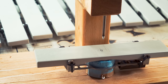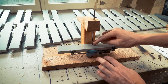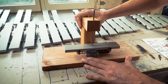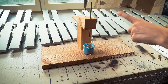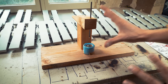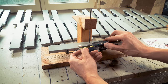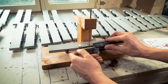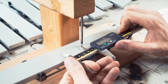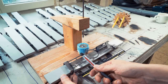These want to be hit to the left, so I'm going to calibrate the jig so the needle is hitting the majority of these circles. I can swivel this over a tiny bit — I'm happy with this calibration. Now I can lock the swivel head in place. Now comes the whole purpose of this jig: I can get a very precise value of how much I need to shift this plate. This is exactly where the marble is always going to drop, and this is where I want the marble to drop. The measurement is 46.5 — so we need to shorten here by 46.5 and lengthen here by 46.5.